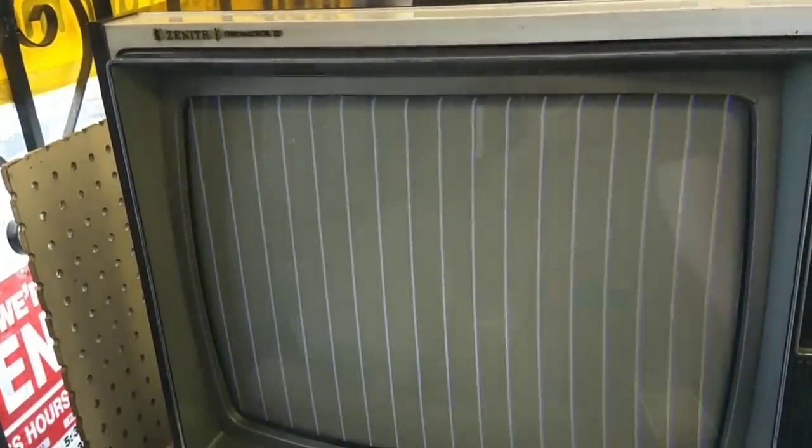Of course, it's locking in now. It didn't do that before. I don't know. It's a set with issues. But we've conquered most of them. I also noticed that this thing, the CRT, takes a really long time to warm up. And when I tested this, it seemed good. But maybe that's also why I've got the blooming problem. It's like I'm cranking the high voltage up more on the grid, but it only gets marginally brighter. So I think it might be worth it to explore the probability that the CRT is a little weak on this. That would kind of bother me, but oh well.